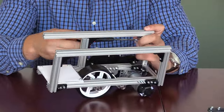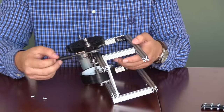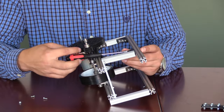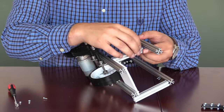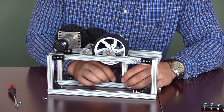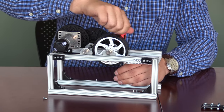Once you've attached all of the necessary screws, we can tighten everything down, with the exception of that one middle pillar — this one should be allowed to slide, though it may be difficult for it to move. Once again, here you can see the entire tightening process sped up. Feel free to change the speed of your player so that you can follow along with each bolt and screw that I tighten, or feel free to tighten the entire assembly minus that one pillar down.